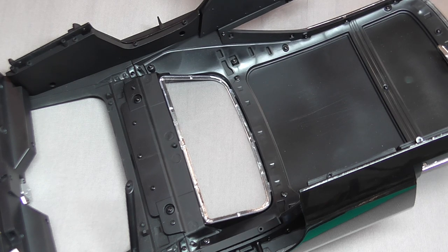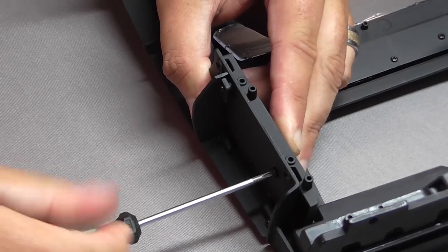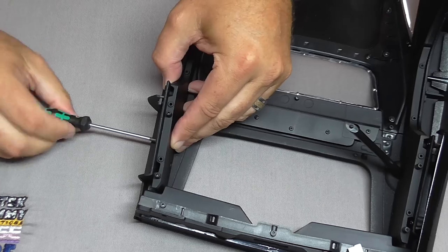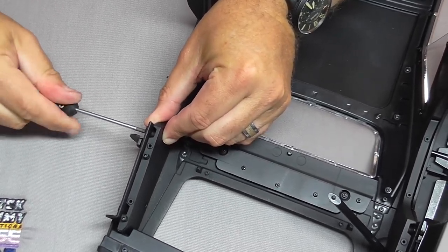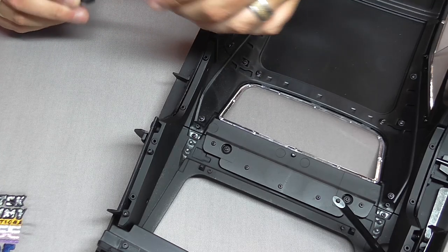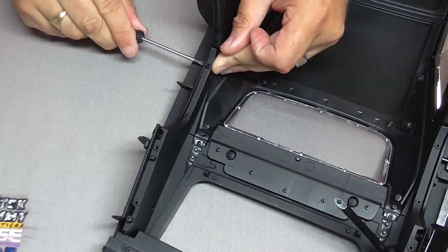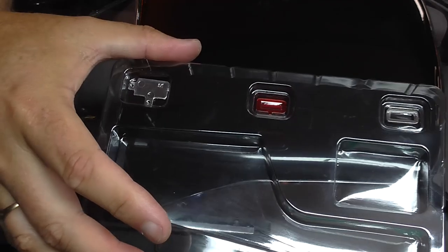It's going to be held in from this side with some SM screws — these are flange screws. Initially we only need two of these: one in this side here and one below it just here. Grab another SM screw because we've got some more holes — one at the top, make that nice and tight, and just one at the bottom here. And then finally just one at this back side. I thought there was more to do in this stage, but that's actually all there is. We've got some reflectors here which we're not actually doing anything with in this stage.